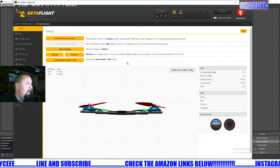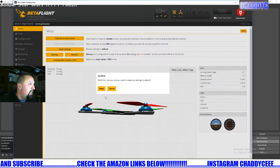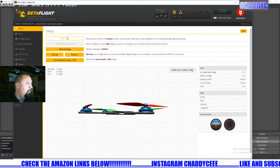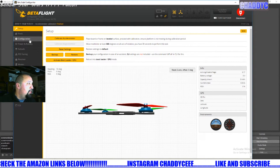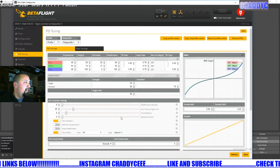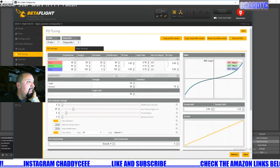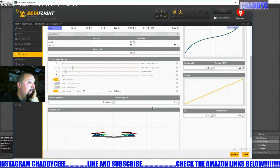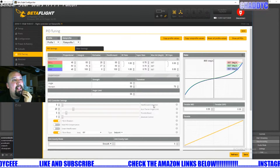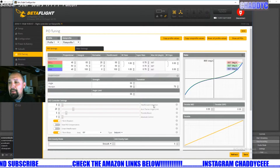Now that it's all flashed, we're going to go ahead and connect to the board - it verified that we have our target on there, which we do. Going to reset settings a couple of times as Mark recommends, just to make sure everything's all good. Calibrate the accelerometer and just go through and do our normal Betaflight setup again. Take a look at these crazy PIDs - I mean, we have I-gains of 175 and 65. Crazy how they come up with these numbers, but I can definitely speak that these numbers are the truth. Going to finish up plugging in my numbers and then we'll take this baby for a test flight.